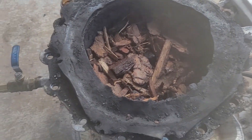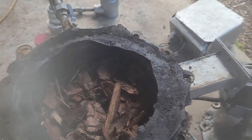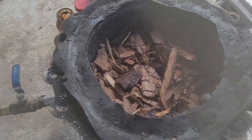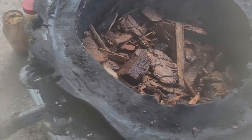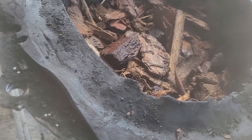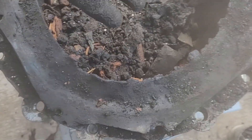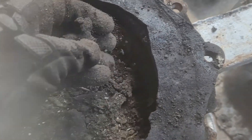Microwave pyrolysis is a little bit different from regular pyrolysis — we need to add a catalyst. That way, it's not only the water in the wood being absorbed by microwaves, but this microwave catalyst or susceptor will get superheated. I use carbon for this, and all this carbon is from previous reactions. You see this? This is just carbon — usually that's all that's left over in the end inside the reactor, this black product which has tons of uses.